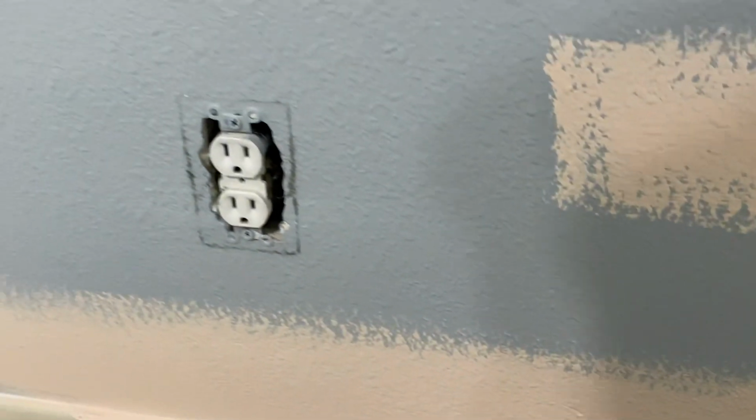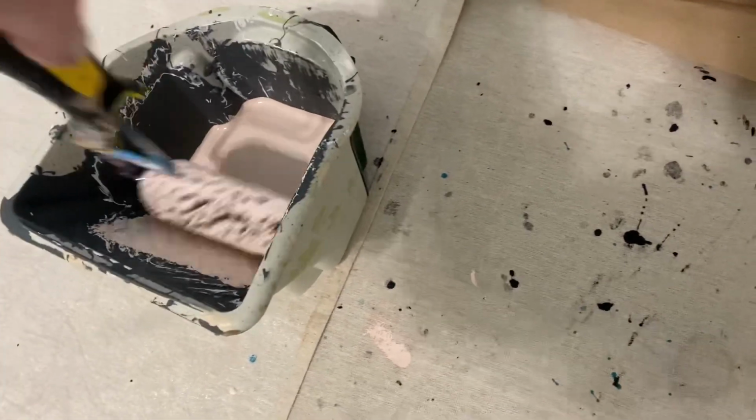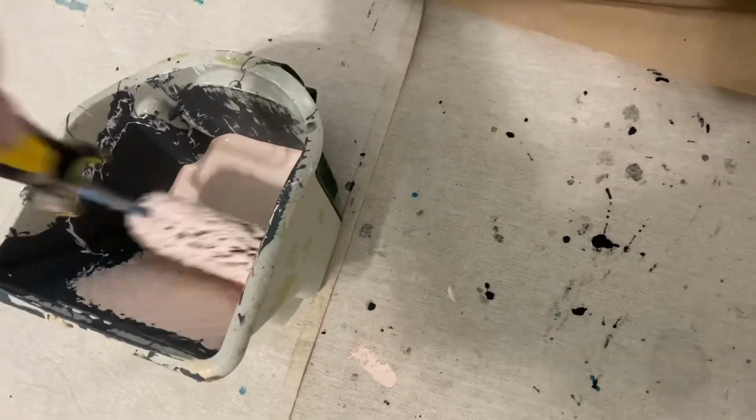But you don't have to use this 4-inch roller at the bottom. Remember, if you're rolling the wall, you're going to come down to the bottom anyway. So you could simply accomplish what I'm doing with this 4-inch roller with your 9-inch roller vertically. This, what I'm doing right here, is particularly important at the top where you can't get your roller close to the ceiling except within about 4 inches without hitting that ceiling. I just show you this so that you realize how important it is to keep the texture.